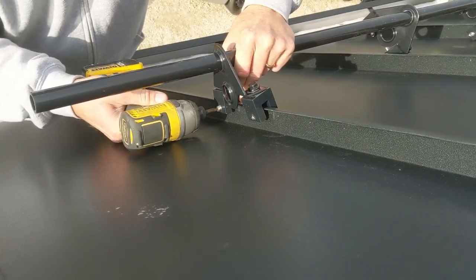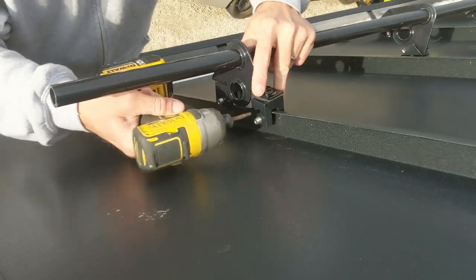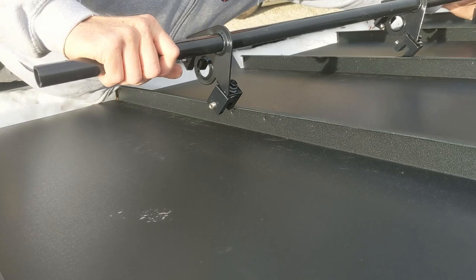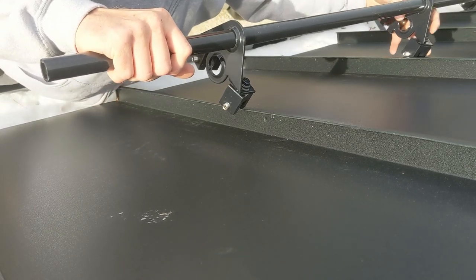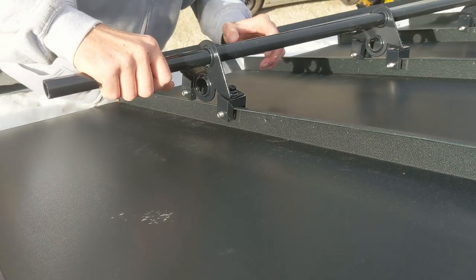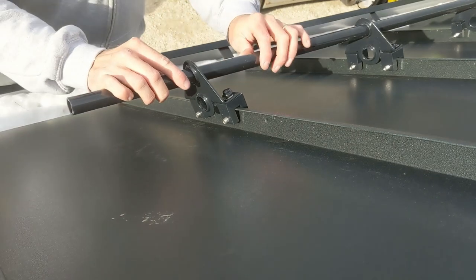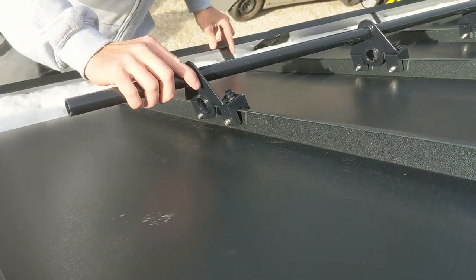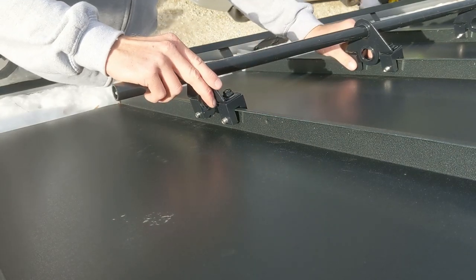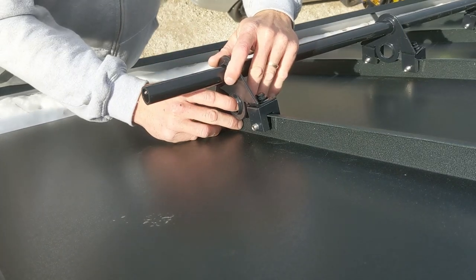Please remember that these systems are engineered to that roof specifically. Our supplier does a takeoff based off of the specs given by S5, and that's why they have dealership capability — they've gone through their process and know all of the calculations. Geographical location and all of these aspects come into play when designing these systems, so be sure to check with the manufacturer, give them the proper roof dimensions, and they will design this system specifically to that roof.